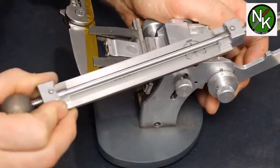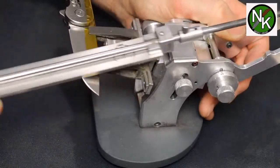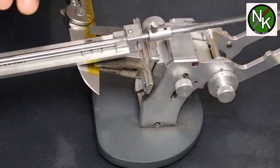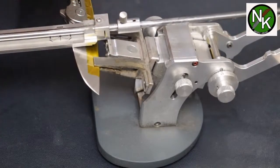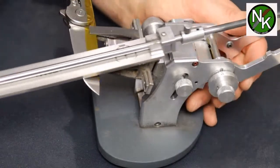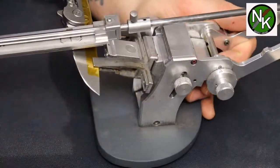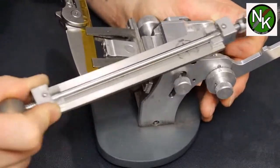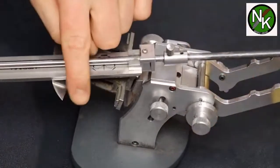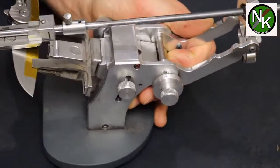So if it goes halfway past, it'll tilt? Inherently, it'll tilt, even if you think it's not, unless you're literally focused on it and applying pressure to this side of it. If you're just holding your stone back here how you're supposed to, it will inevitably go off the stone or off the edge, and it will do what I'm saying and mess up your tip. So right now, if you watch my tip, I'm barely allowing the stone to even go past the tip.